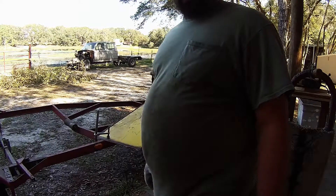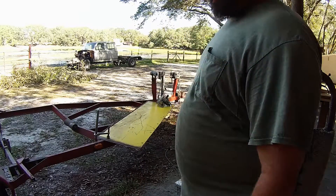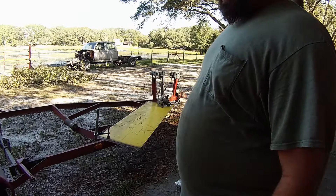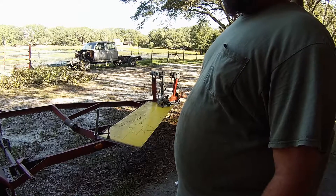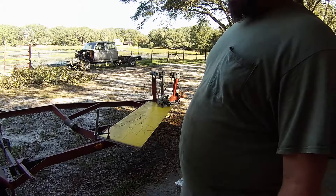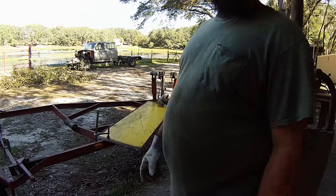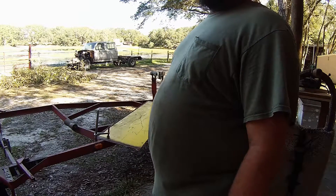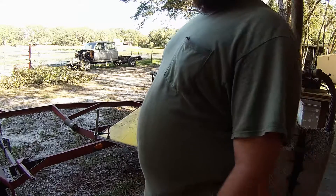I'm starting these boat fenders. I got the one fender already done - if you watched the last video. This one's all laid out. The last one I cut out with cutoff wheels on the grinder, it just took forever and I burnt through all my cutoff wheels. Had to go to Harbor Freight yesterday to get more, so instead I bought a metal cutting blade for the circular saw. I got this one all laid out ready to cut, got my bend lines in there too.